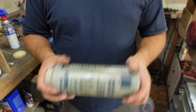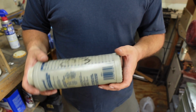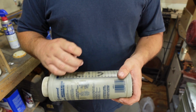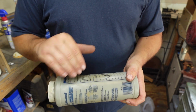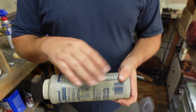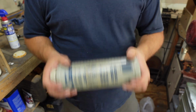and start shaking it. I will tell you this, the trick to doing this by hand is not to just go all crazy. You want to kind of shake it in ways that's going to make it to where all of those rocks hit the blade at different angles, so you don't end up with a bunch of lines going this way or this way. You want those lines, the stone washing, to go everywhere on it and not look uniform.